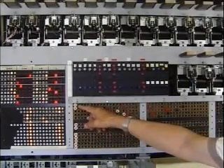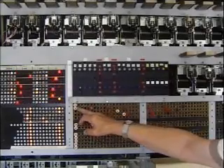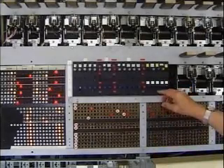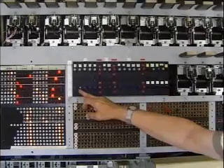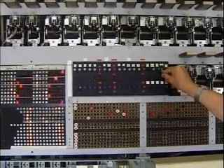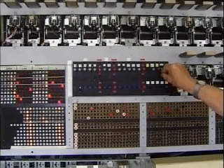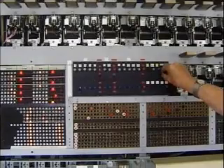The K1 wheel will carry and step every time, so you'll go through every possible combination of K1 and K2, but stepping five — five times faster — on the K2 wheel. To engage the multi-testing, we set the multi-test there, we're stepping on K2, and now we can engage the stepping. You can see it's now stepping round in a five sequence, and that is now looking at five bits at a time all the way around, going five times faster through the complete number of settings of the K2 wheel.